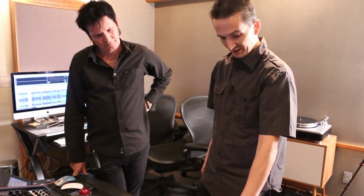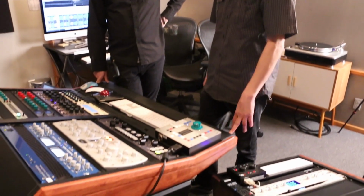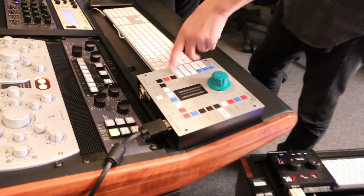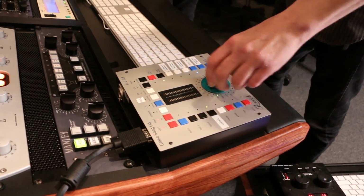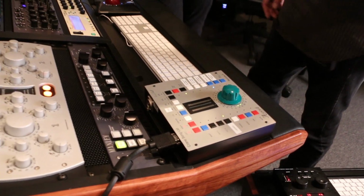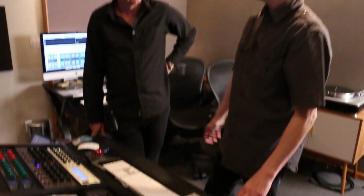And it's that simple. If you're doing surround sound, you can hit one button and turn this all into surround sound. It takes a couple more input-output boxes. I have one for stereo. I think it takes 3 of them to do surround sound. And it also does polarity, mono, dimming. A cool thing that you don't see on any other piece of equipment is a 16-bit truncation on the input. And what that does is allow me to hear dither, truly hear it, because it takes the input all the way to the output and makes it 16-bit.